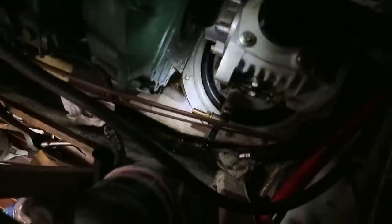And basically, from what I've seen here, I believe it would be possible to misclamp this seal. If it's not concentric when you're tightening it up, I think you could make a hash of this, and that is not what we want. So I've got it loose and I'm gonna jiggle around with the seal and the clamping ring until I'm happy that it's all concentric, it's all centered. And then I can start to tighten down on the bolts.